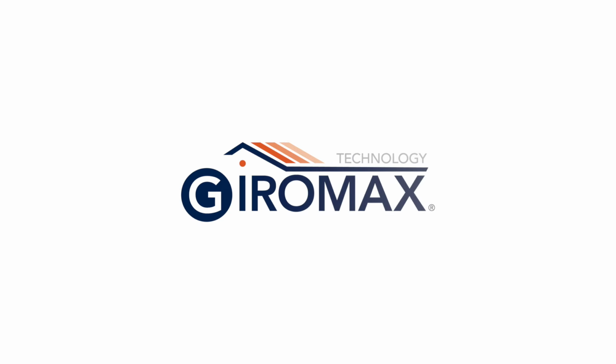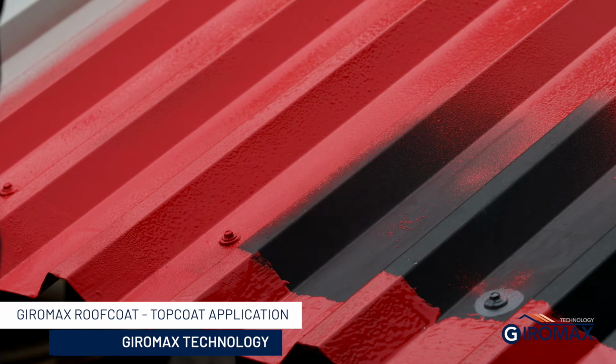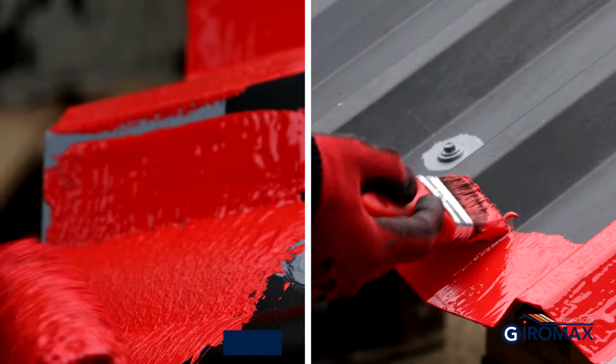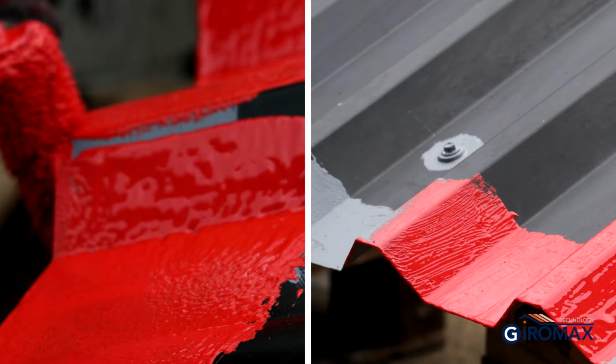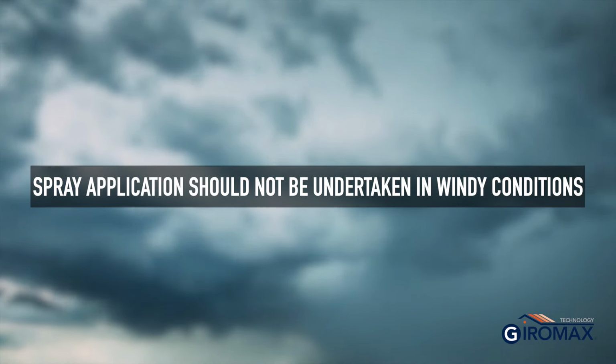The application of Giromax Roofcoat can be done in several ways depending on the nature of the project. Spraying is the most efficient method, especially over large areas, however it can also be applied by roller or by brush. Before deciding on the method of application, considerations should include weather and situation. Spray application should not be undertaken in windy conditions.